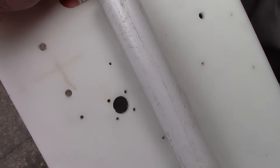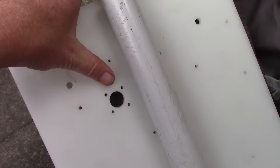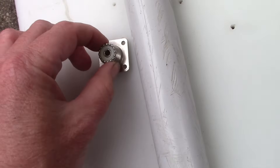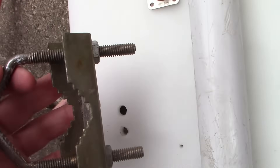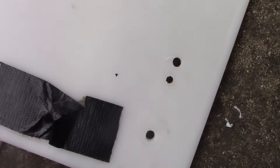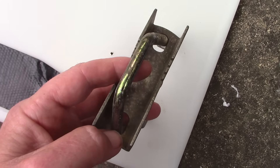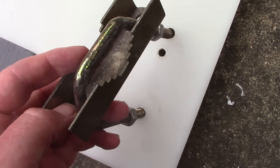But today I'm going to do something slightly different with it. One of the clues is some holes I'd already drilled as part of a previous project. If you've done anything in radio before, you'll recognise this as being a mounting for an SO239 antenna socket. So I'm going to put that back in — that's the first stage. Next ingredient is this U-bolt, probably from an old TV antenna. There are holes there that suit it quite well, and I will mount it on the other side so it can go around a metal pier railing. This will give me a vertical antenna that I can mount on the pier, making contact with the pier through this to act as the counterpoise. That should give me quite an efficient vertical antenna.